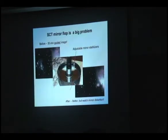1 or 2 points on the what? That you have 1 or 2 points that get spring loaded, instead of having all 3 with screws alone. You can still have all 3 screws, but if you have 2 of them, or even 1 of them, so that they're all touching all the time, yes, with the right tension. Just make sufficient tension on it. You don't have to do much.